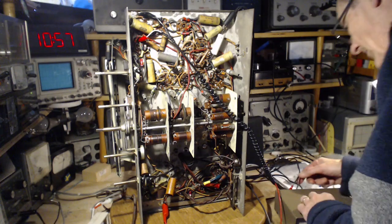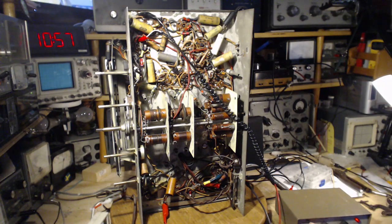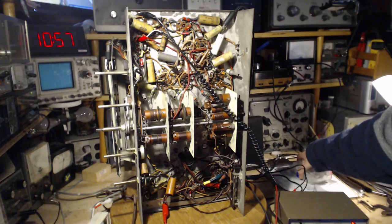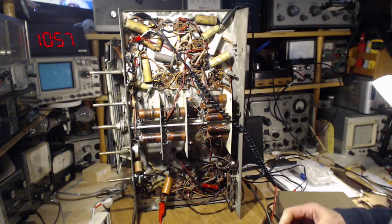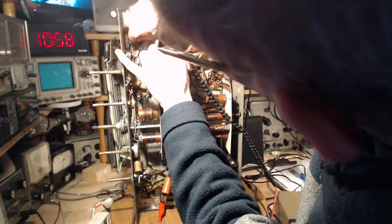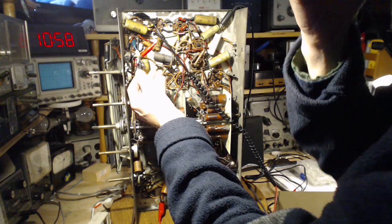Now we're going to fire up the radio. My speaker was not right — there's DC in this speaker, but that pop is from this amplifier itself — it's always been that way. And I did all this with 200 volts still live on the radio. That's twice now I've forgotten to shut off the external supply. I'm going to include a clip capacitor here — may not need it, but I feel better with it there.